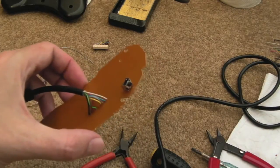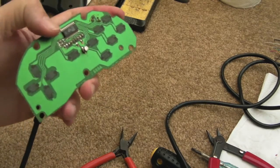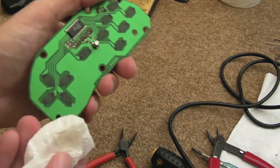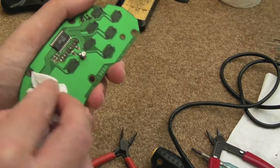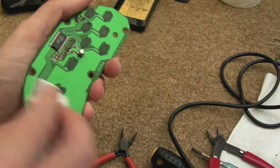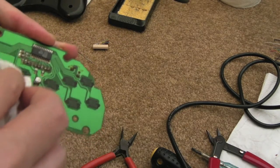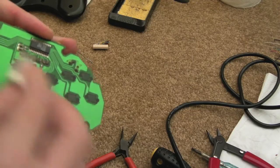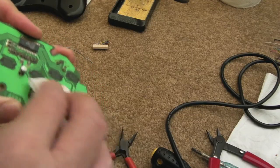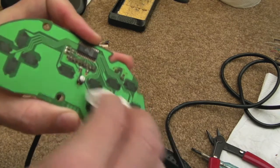I can see I've got the wires joined onto the board now. One final thing — and I've shown this in some of the videos as well — just clean these contact pads up. Just use a damp cloth and don't press too hard, just give them a wipe down to make sure you've not got any bits of dirt and dust on there. That ensures you've got a good contact when the carbon pad presses onto it.